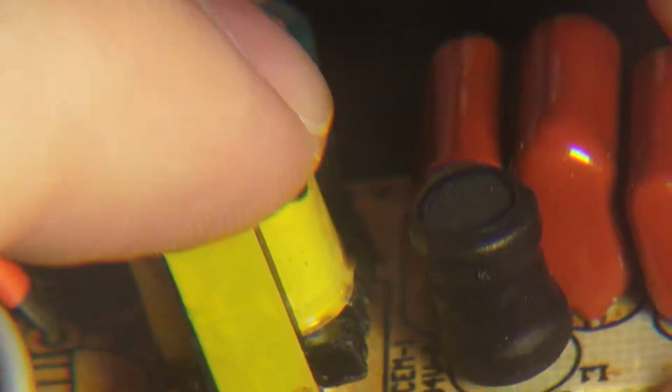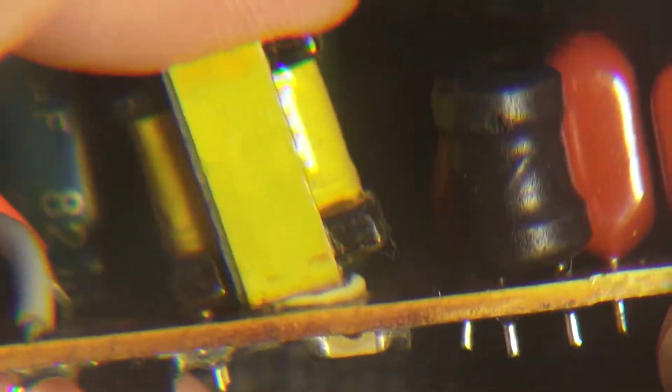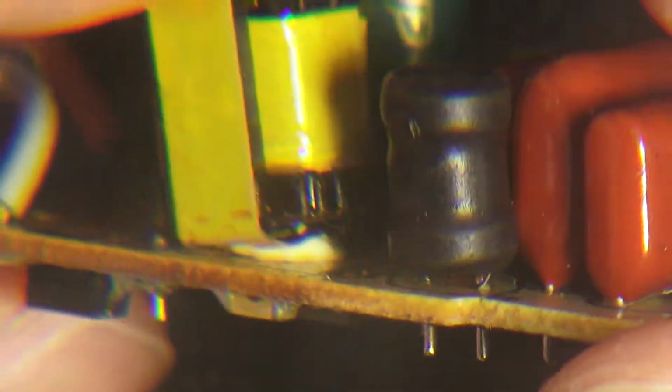And you've got several large high voltage caps, you know, high mains voltage. Switch supply, the actual transistor. It's really weird, the transformer is loose. It was attached at an angle, there's this double stick tape, I think, to hold it down. Are the solder joints broken? No, the joints are fine. That's really dodgy in my opinion. I don't like that at all.